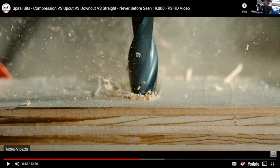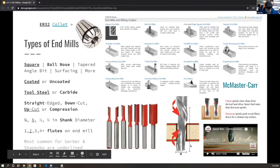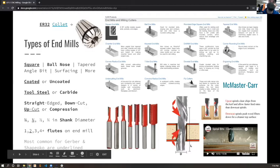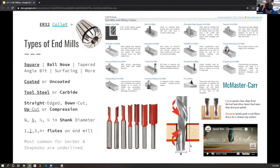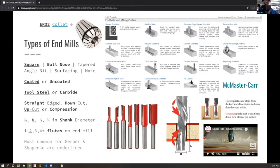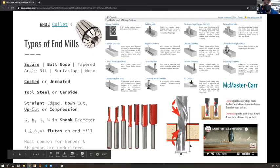You could cut a large area with an up-cut bit just to remove material, then come back with a down-cut or ball nose for the finish - those are roughing and finishing passes. The standard go-to would be: square coated tool steel, up-cut bit, quarter-inch shank, two flutes. That's the most common. If you're unsure about different options, stick to that and you'll be fine. Switch to a down-cut for finishing and you'll be even better.